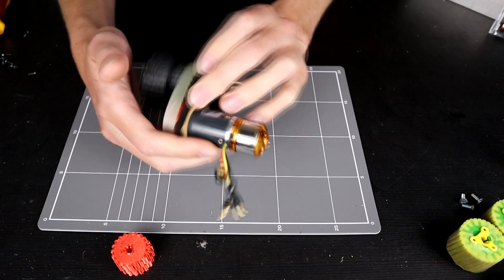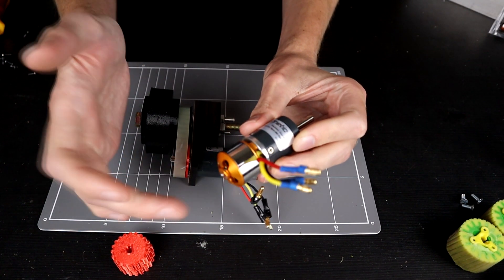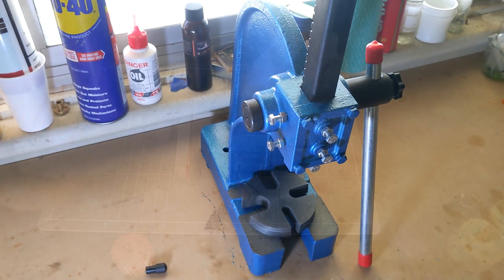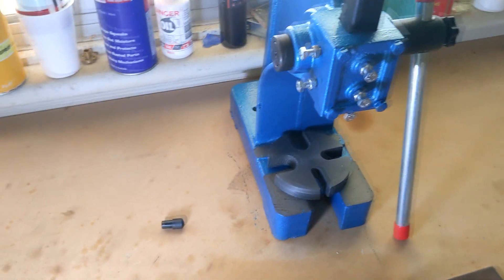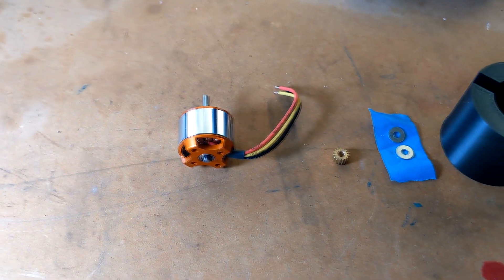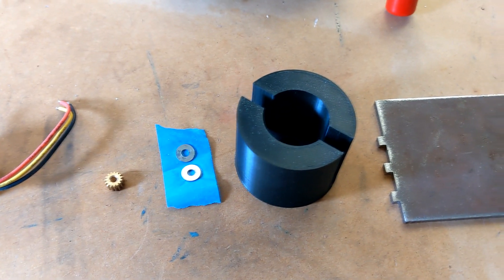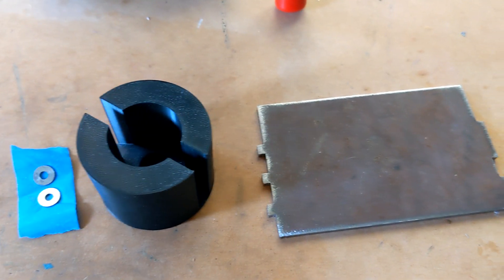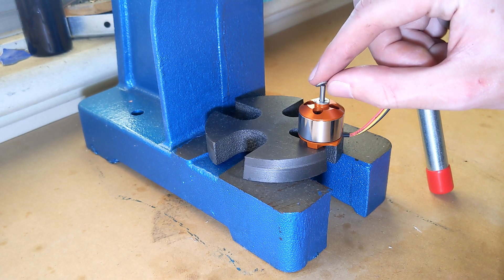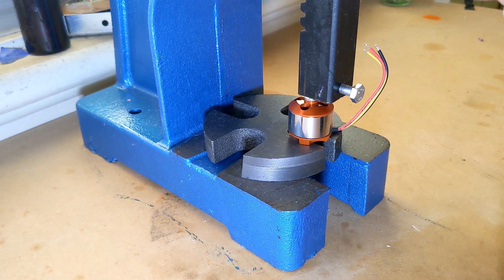We're going to do a conversion really quick — get rid of the motor off the back and put one on that is definitely a thousand KV, because pretty sure this one is not. To do this you need an arbor press, which is a big mechanical press, a motor, a gear that has a hole that will be a good press fit on the shaft of your motor, spacers to give you the distance down to push the motor, a guide so that you can push everything straight, and then a steel plate to use as a backstop. The actual process is really, really easy — put the spacers on top of the motor and press to push the shaft all the way through the motor to the desired distance.